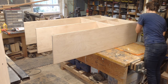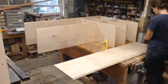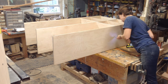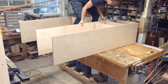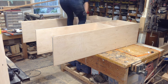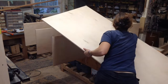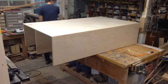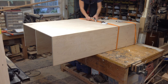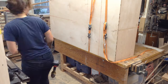I cut those all at the same time so they are all identical. Since I already had these dry fitted together, gluing them up was pretty easy — I could just take one side off, it's already square, add glue to it, reattach it, do the exact same thing to the other side, and then the same thing to the middle. For one side of the middle I could screw it together; the other side I won't be able to, so I use ratchet straps until it sets up. Once the backer is in place all those screws will hold everything. The backer on these is very important — I'm assuming they'll be screwing hooks into it, and it really helps square things up so these aren't parallelograms that can shift or move.